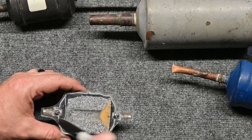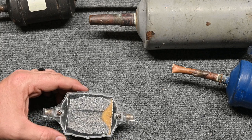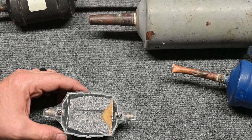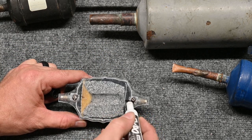If we put it in the other way, we're going through this filter material first and the desiccant can push into the system. So we don't want that to happen. It's fairly rare for that to happen, but I have seen that before — this desiccant comes loose and ends up trashing the system, clogging up the filter dryer.